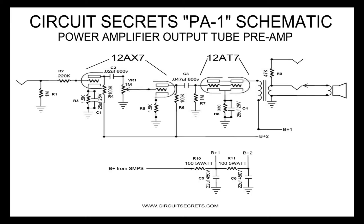Another unique design choice is that this preamp has no tone control. Instead, just as was done in many old designs, the tone of the preamp is changed by changing parts. Once you have built it to your liking the tone never changes. The main benefit is fewer moving parts and no extra parts to reduce the output signal.